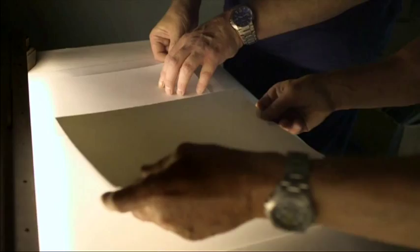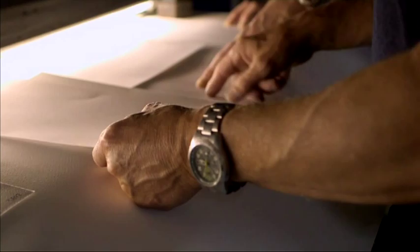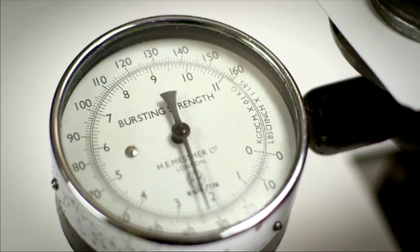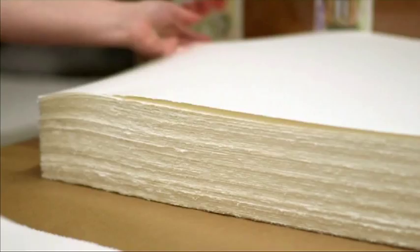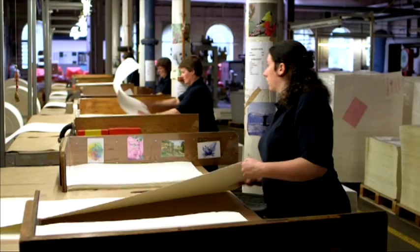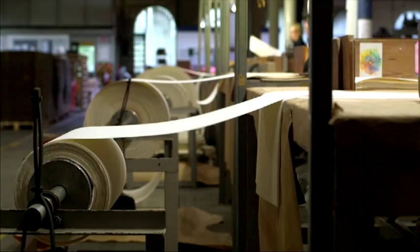The sheet is now made and rolled up to form a reel of paper. The paper is constantly checked for dirt and faults. Our quality control department at St Cuthbert's Mill examines every reel of paper — up to 30 tests are carried out to ensure it meets our strict standards. These range from surface and colour matching, painting the sheet, to testing the sheet's strength. The surface is matched by eye to a surface standard and compared to previous makings. The sheet is painted with a special mixture of pigments developed to highlight any faults on the sheet. Surface sizing is tested using pen and ink to determine and quantify any spread. Once it's passed quality control, the reel proceeds to the saw, where every sheet of four-deckle paper is hand-torn and again inspected. This process is a time-honoured tradition showing the care and attention St Cuthbert's Mill puts into its paper.